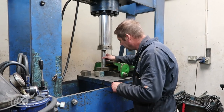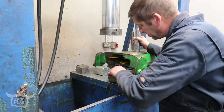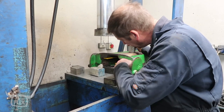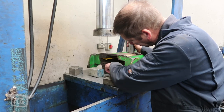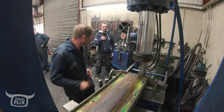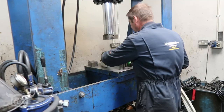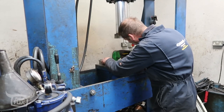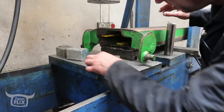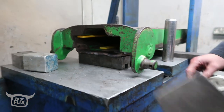Explain to me what you're going to do. Well, I'm going to level the bottom of this here where somebody's lifted the hook up between the slide and the hook, so we're just going to level these bumps out of it. Which pressure do you think it'll take to put that back into shape? I'd say about 40 odd ton. 30 to 40 ton. There's one side done, one half done there. See the difference. If it was that hard to straighten it wouldn't have been that easy to bend in the first place. We just straightened it roughly to get the slide out — a wee bit of heat.